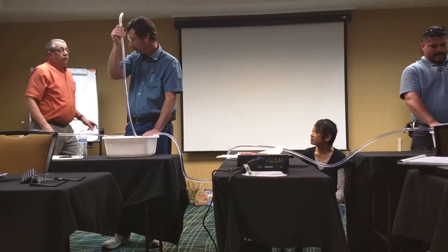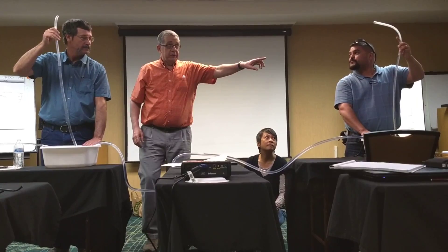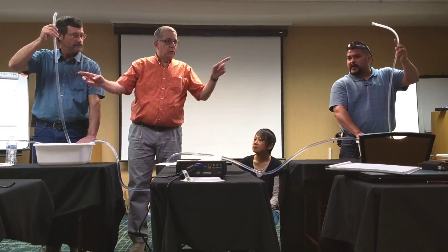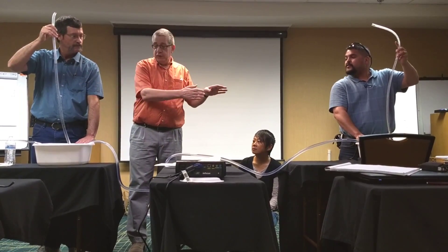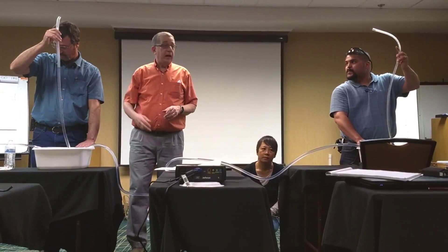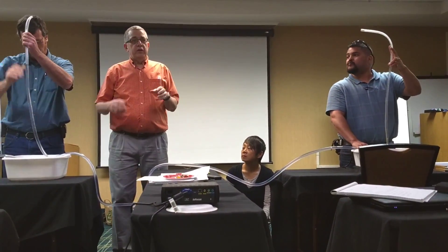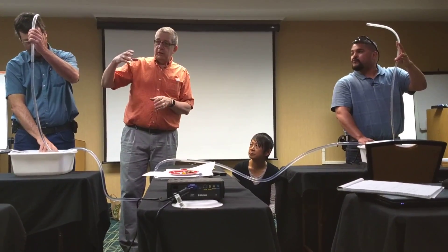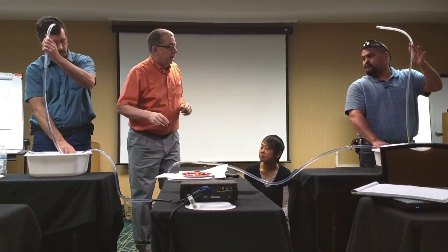Now, do you expect that the water level in this piezometer here is going to be higher or lower than the level here? Which is higher? High. And this is going to be lower - why? Head loss. It's friction loss as the water moves through here. And we're not measuring any loss there. This is a hydraulic grade line. The hydraulic grade line is how high water would rise in a piezometer. You can just connect the dots from there to there if you're drawing the hydraulic grade line.